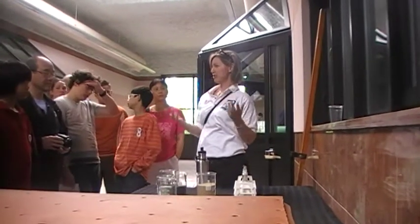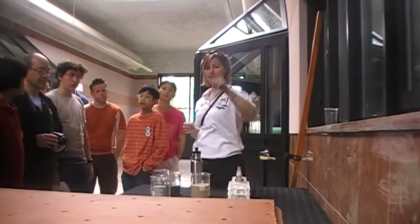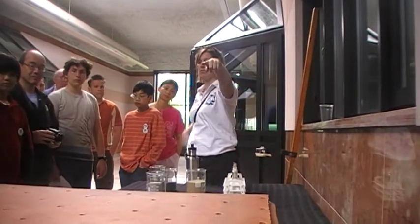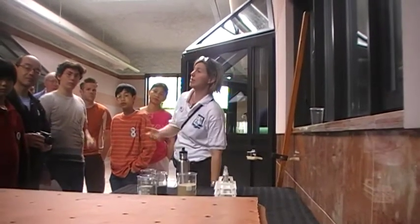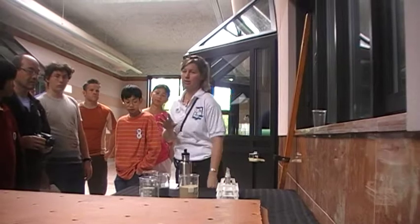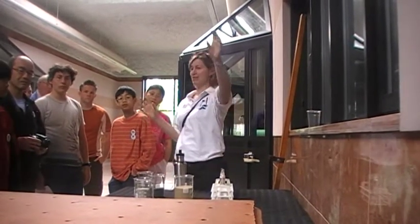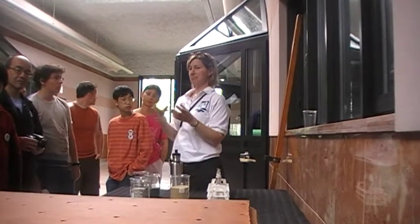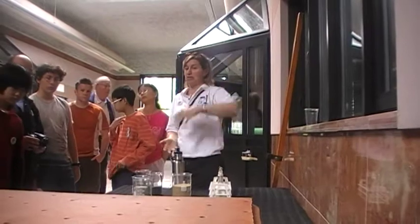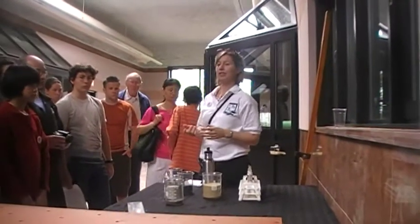Technology, improvements, research has made us change things along the way. So I think that the clay one on the end there is from, I think, the 80s. Some of the filters have had the media changed out and the drains replaced. And there's smaller holes in the top, so things got better. They did research and smaller holes in the top meant that you could change the media above because it wouldn't go through. So bigger or smaller diameter gravel would have worked.